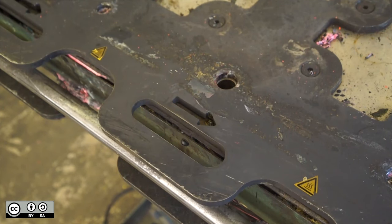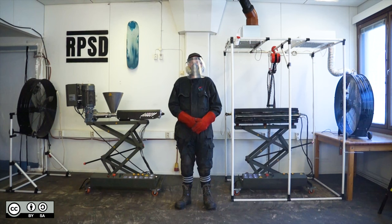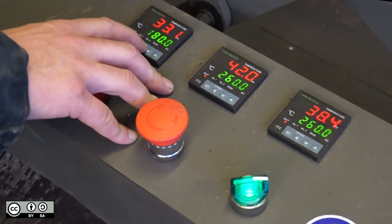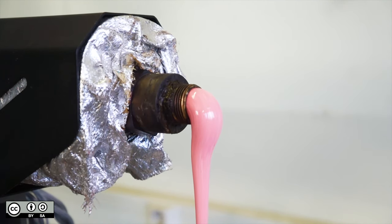Notice the arrows on the horizontal plate — this shows the direction of the flow of the plastic. Preheat the extruder and the mould. Make sure your ventilation is switched on; you're also going to need some safety equipment. Set the PID controllers to the required temperature. While they preheat, you can prepare your plastic. To check how the colour comes out, you can extrude a little bit.